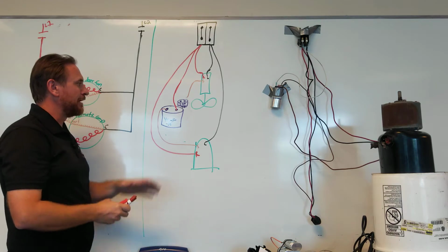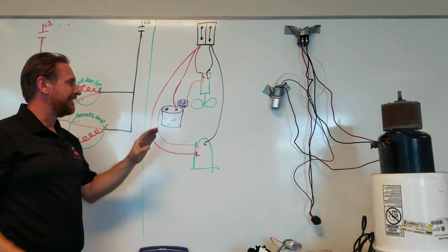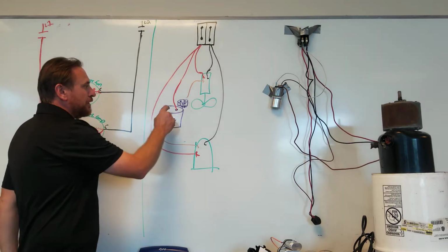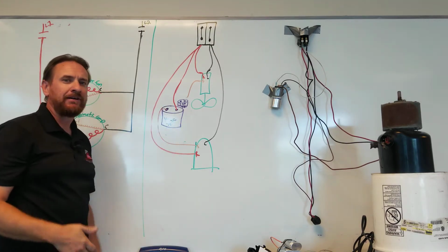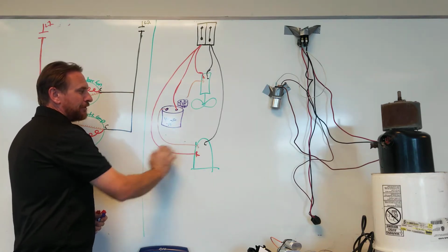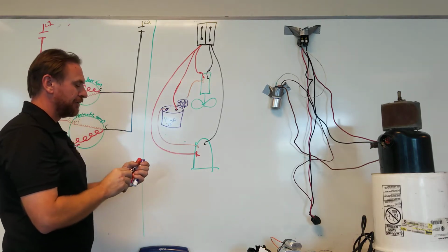Now there's a saying about which one is supposed to be the one to power it, and really nowadays it's not as big of a deal as long as you mount it metal to metal to metal, upright when possible. You pick one for power in, the other one's going to be power out. It's alternating current, changing direction 60 times a second. Now we've powered our compressor. We must also power our capacitor for the condenser fan motor.